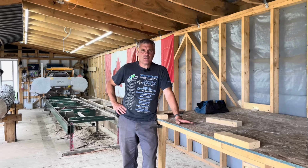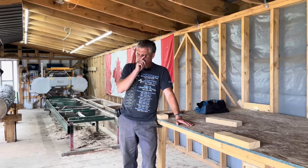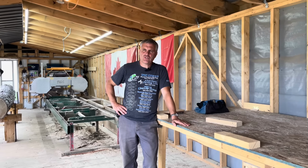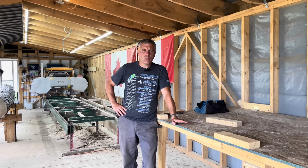The reason I'm doing this is I cut lumber and build garden shed frame kits. I cut all the wood to build a shed 12 feet by 12 feet, frame only. What's included in the kit is the floor joists, the boards for the floor, the walls, top and bottom plate, all the wall studs, and 7 pre-built trusses.